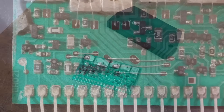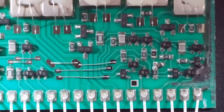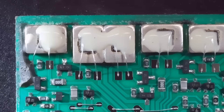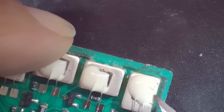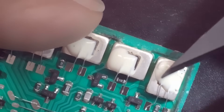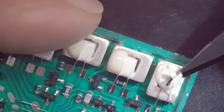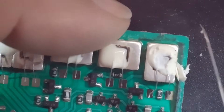Let's put this under the microscope. The board has a bunch of individual resistors, diodes, and transistors, plus those six big drive transistors — which in the block diagram are shown as Darlingtons. You can see they are chips mounted on big heat spreaders. The transistor silicon chips are mounted on those slugs, which attach to the PC board, which then attaches to the aluminum base for additional heat spreading and connection to the heat sink.